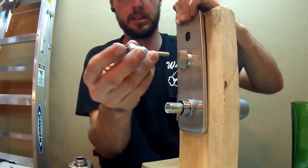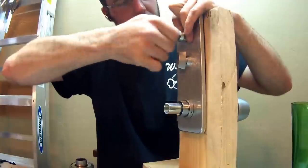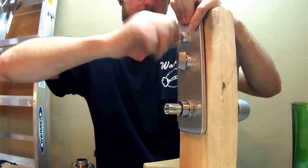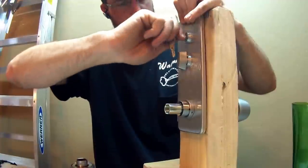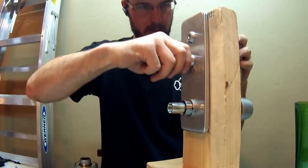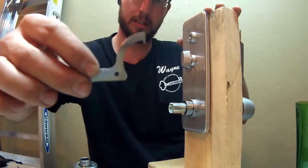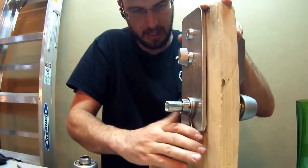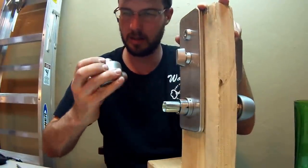This is the key lock — the changing cylinder up here. You're just going to thread that in there and get it started until the lock starts to set down into the notches, then wind it right up. Thread it right on, pick a nice stopping point, and pull the key out. These little tools are designed to fit in one of these holes to grab and pull as needed — always save them because they come in handy. Then we're going to put the knob on.